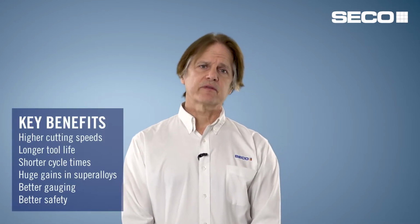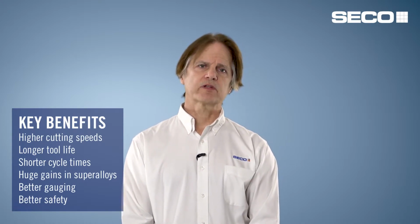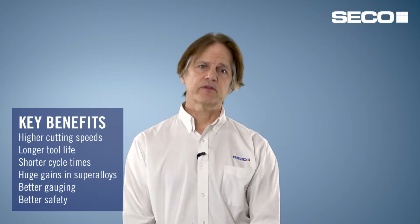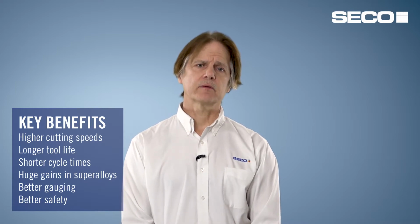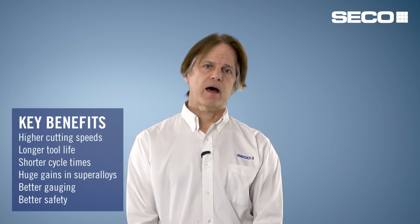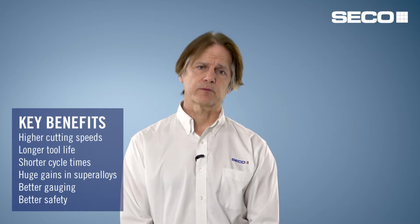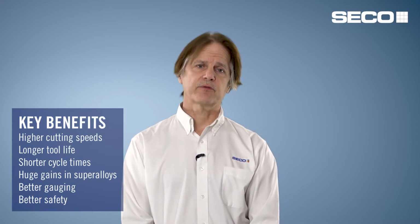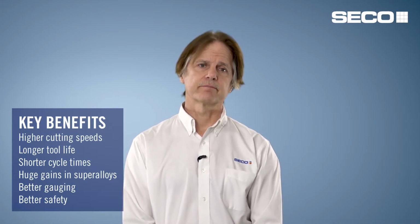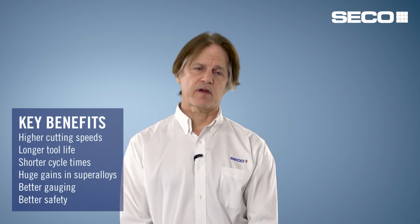To review the benefits of the Seco Jetstream threading: efficient cooling at the cutting edge, by which higher cutting data can be achieved, which means you can go faster. Increased tool life, and the possibility to reduce the number of passes when threading, meaning reduced cycle time. High dividends for super alloys and high temperature alloys, meaning this product works very well in that type of material. Improved surface finish on the threads, which makes for better gauging. Improved chip control, especially for safety in the shops.